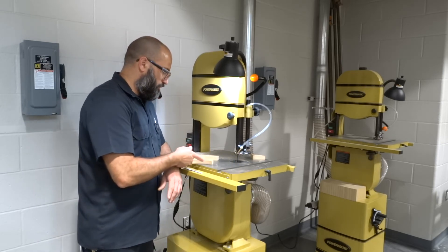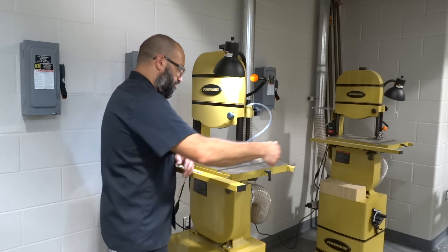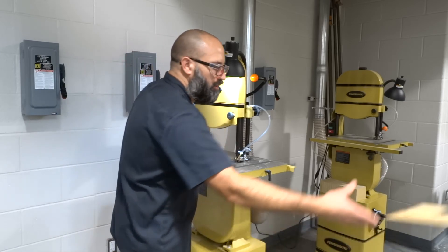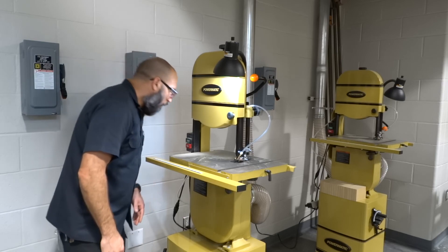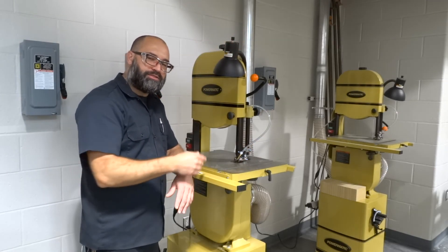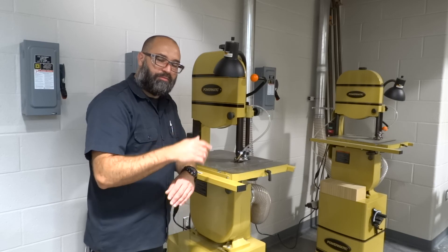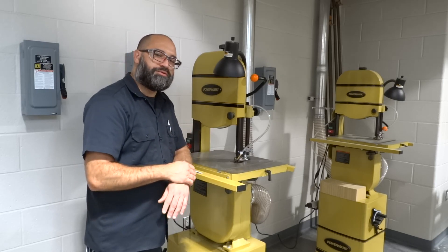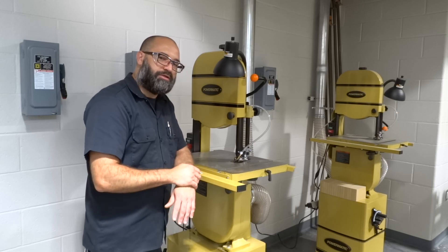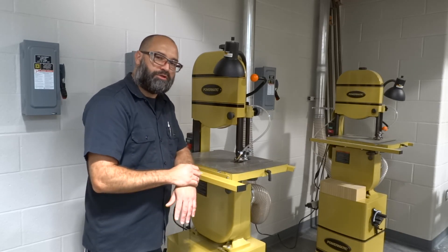Once I want to clean this machine up, I've got to wait for the machine to come to a complete stop. Once it stops, I can reach behind and loosen that knob to lower the upper guide, and then remove everything from the table so I can clean it up. The smartest thing to do is just blow all the dust onto the floor, grab a broom, and sweep it up to the dust collector. Then I would turn off the light, close the dust collector door, and turn off the dust collector. Pretty simple machine to use — however, if you're not paying close attention to where your hands are, you might run into some trouble. Hopefully that's enough for you guys to be able to pass your safety test in my class, and for those people out in the world, for you to figure out how to use a bandsaw. Good luck, and thanks for watching.